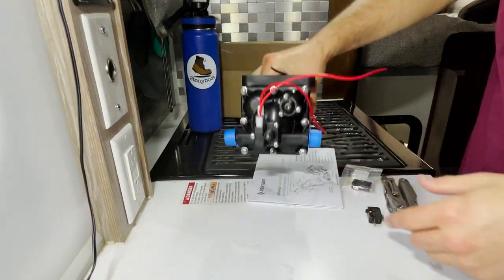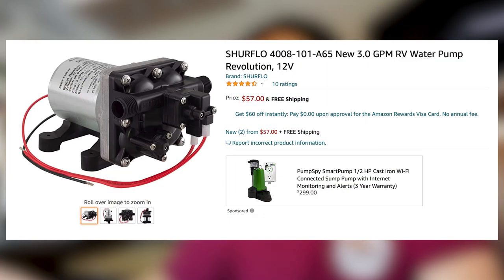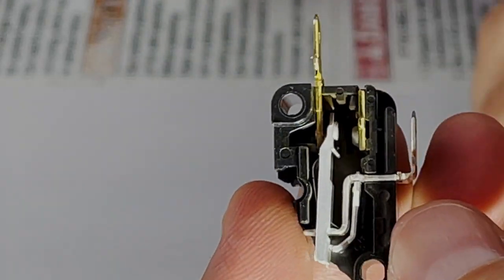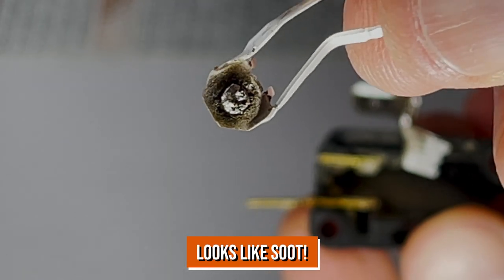So that's all that was. This two-pack cost about $8, so that's $4 a switch, and the pump itself was $60. Now I have a perfectly good spare pump to keep on hand. I can understand why this wears out — when you trickle the water, the pump cycles click click click click click constantly. I don't know what the rated cycle life on these is, but it's going to be pretty high. I expected a complicated pressure sensing system, but it's really just a diaphragm with a spring and a little switch.